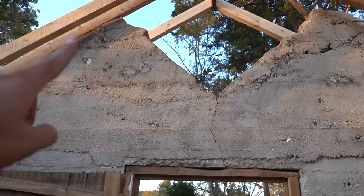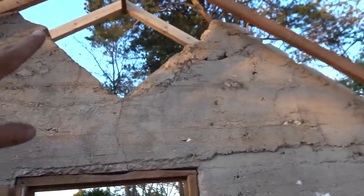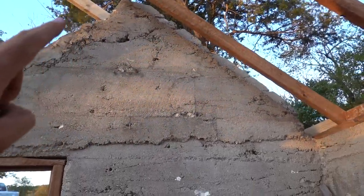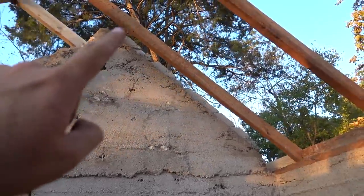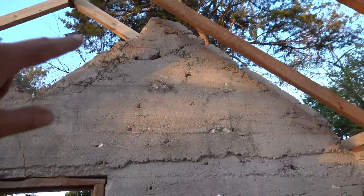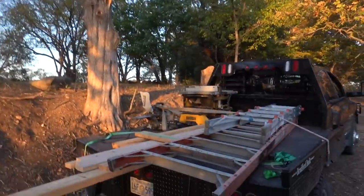It's resting on the concrete, so a lot of that weight on that ridge board is on that rafter. Over here, we were going to do the same thing, but there's a high spot in the concrete, and we couldn't get the board to go underneath where the OSB will be. So basically, the decking would be too high right there, and all we really need to do is rip a board down. I got one already cut. I'm going to take it home and get the table saw.